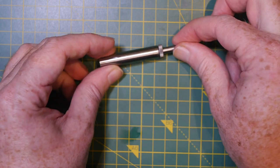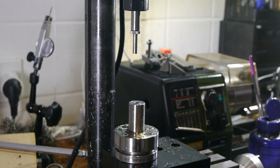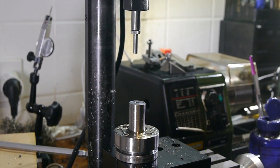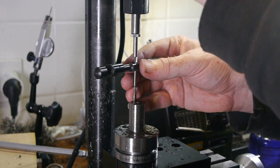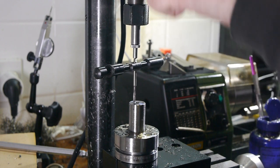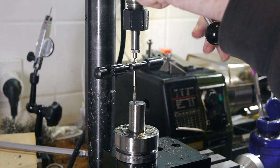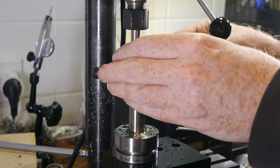Overall it seems to work fine, though I'm certain it would be more rigid if I was more careful with the clearances. Here's a short snippet of the video from the Watchmaker's faceplate series of setting up the follower in the Proxxon milling machine. I had to clamp the tap wrench around the round part of the tap, as the square section was too short to go all the way through, and the follower is much wider than the tap. But that's a problem for another video.